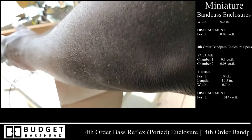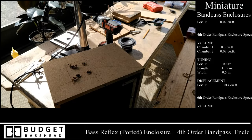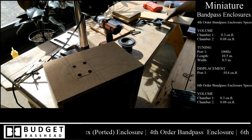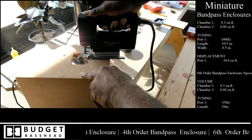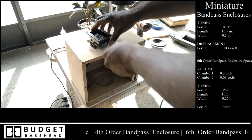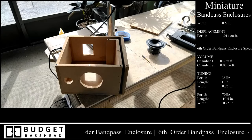So once I got all that going, once again, get the drill bits, make a guide hole, in this case four, because we are going to be doing a corner. You can use Forstner bits to do this as well, get those guide holes going. Actually, it'd be a lot quicker if you do that. And this is the test fit, and it works. That's a success.